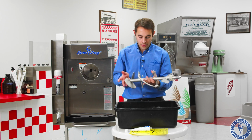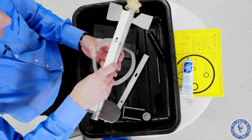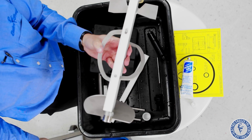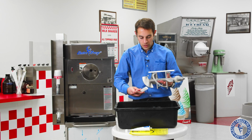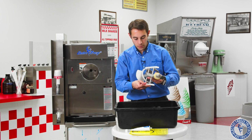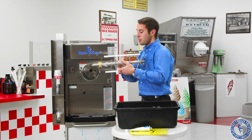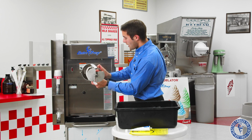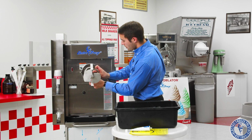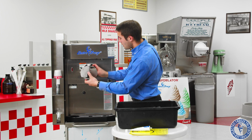And our blades. Okay, now we being in November, what did we say? The odd circle towards the back. Okay, odd circle towards the back. Okay. Now when we put this in, just like when we took it out, we want to have a blade on top and a blade on bottom. So we're sliding on the skis. Okay, you can think of it like skis.